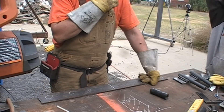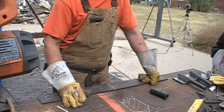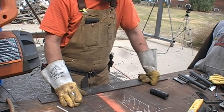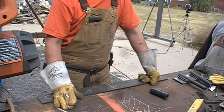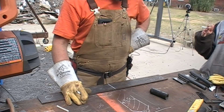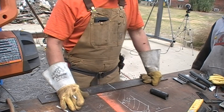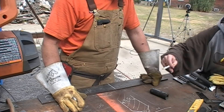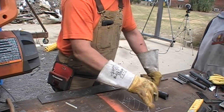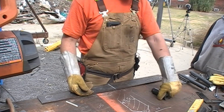Would it be better to bend these here and here and come straight back, or cut them and weld it? I'm leaning towards welding it. The reason why is I don't know how I'm going to bend those, and I think structurally it would be better to weld it — because then it'll have a point instead of a rounded bend. I don't know if being at an angle is going to make it want to pull back. It's through-bolted through both of these, but up here it might want to round out. And how do I even bend it in the vise when that's only an inch and a half wide? I think welding will help prevent movement — if it wants to move, it won't move that much.